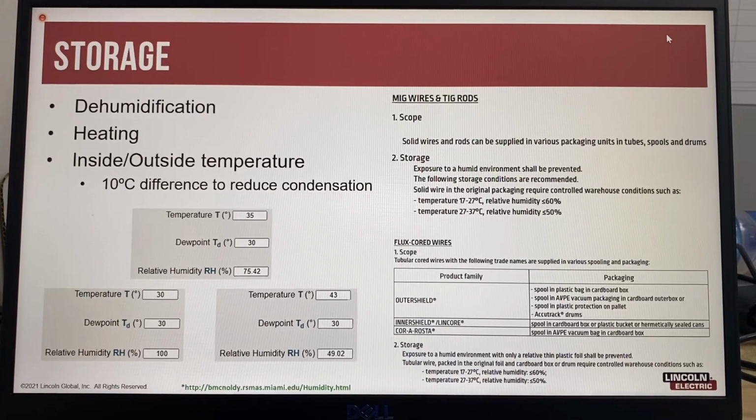The best way to control humidity is to use a dehumidifier. If a dehumidifier is not available, the preference is to use heating rather than cooling to reduce relative humidity. This one is really interesting because a lot of times when you visit controlled environment storage, it's usually cooled because for some reason, especially in the tropics, people use air conditioning or cooling to reduce humidity. So while you don't feel sticky, it's not actually reducing the relative humidity.